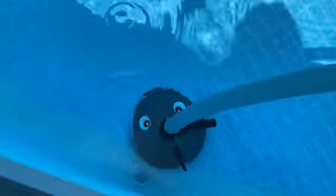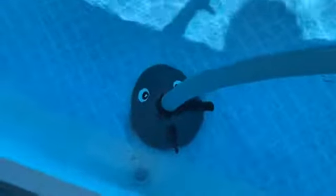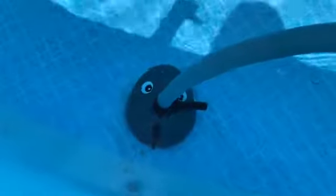So I'm just setting it up to show you the rubber piece that I changed out. There's the other one in my basket. I'll take that out in a minute. So when you put it in, you're gonna turn this upside down like that. Because if you have it set up like this, it's gonna cause you to lose prime in your pump, which just happened to me because I forgot. Okay, so it's kind of sitting here in the corner right now, working its way out gradually.